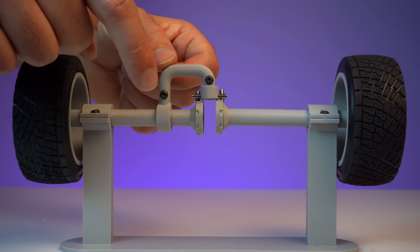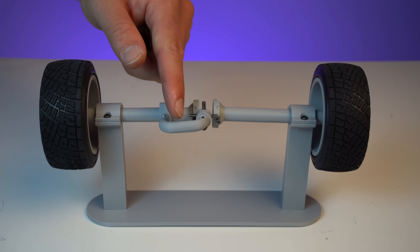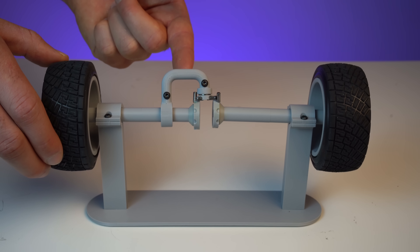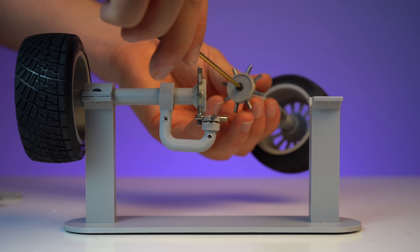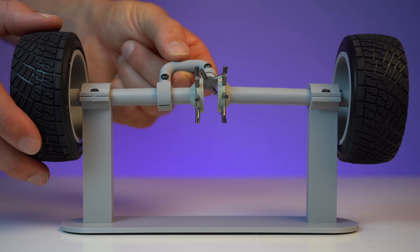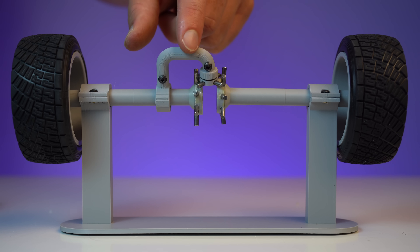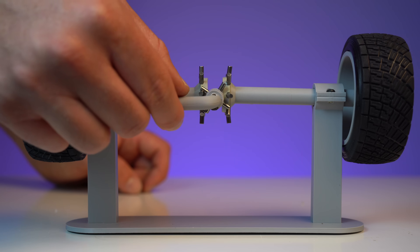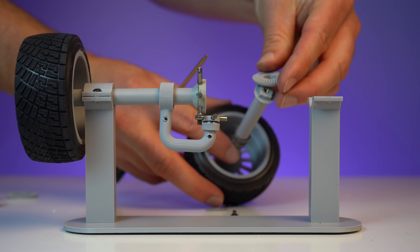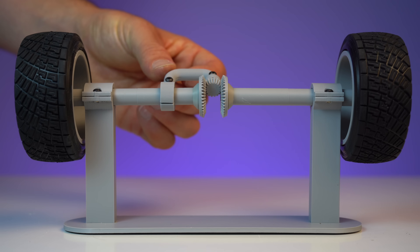Let's put the crosspiece on a pivot so it can swing in either direction. Now it can drive both wheels at the same speed, and because it pivots it lets one wheel turn even when the other has been stopped. But if you drive it too far, the crosspiece loses contact with one of the spokes — we need more spokes to maintain contact. Now when we stop one wheel the crossbars continue to push the spokes of the free wheel around. To reduce jerky action and backlash caused by wide spaces between spokes, we can make teeth in constant contact with one another, with edges cut to fit together more smoothly and silently.